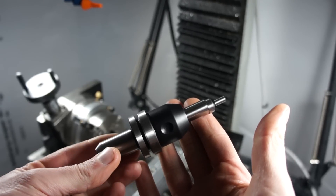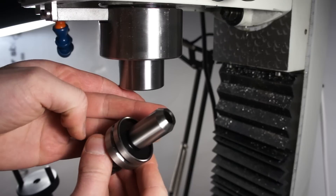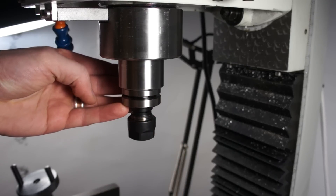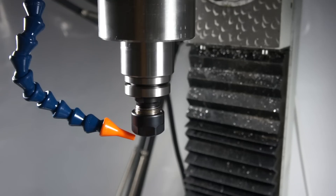The next choice I had to make was the collet system I wanted to use for larger end mills. I rarely use half inch sized end mills — those are for big roughing operations. I got a set screw holder after watching NYC CNC's video about how much tools actually get pushed offline from a set screw holder. They're more than concentric enough for my purposes, so I bought one to hold my indicator and I'll buy more for roughers later. For the collet system I decided to go with ER16 — ER32 is massively large and hard to get air blast under, and 3/8 inch is probably the biggest end mill I'll use. Most of my end mills are going to be quarter inch, one eighth, and that size, so ER16 was more than ample and gives a really small nose on the collet nut.